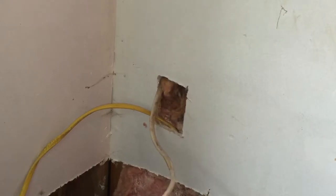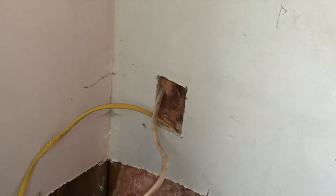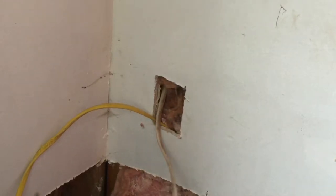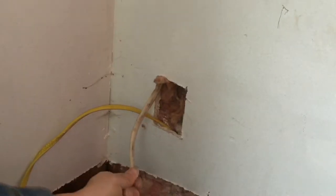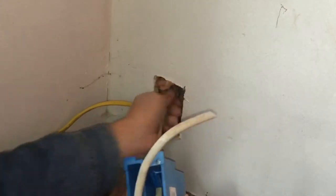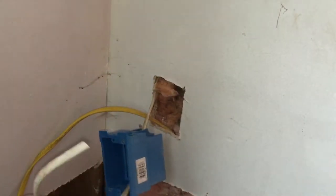I'm sure if you talk to an actual electrician, they'll tell you to cut these before. Because you're not supposed to have too much Romex inside the box — I believe you should have about a half inch of Romex sticking out on the inside of this box, which I think I can still do.